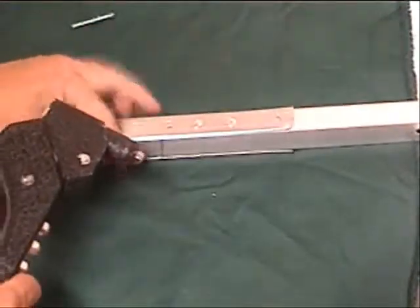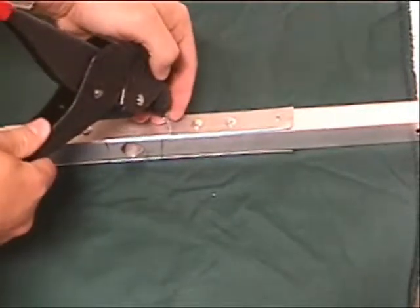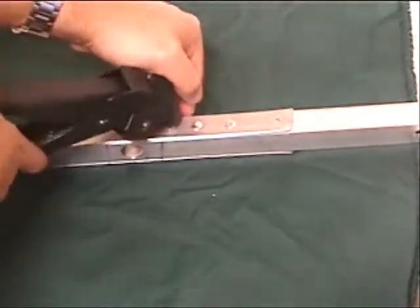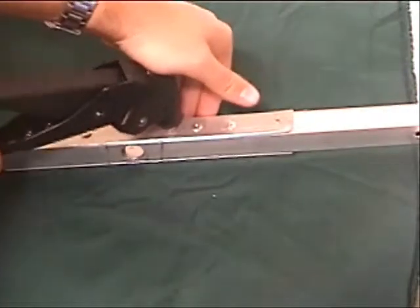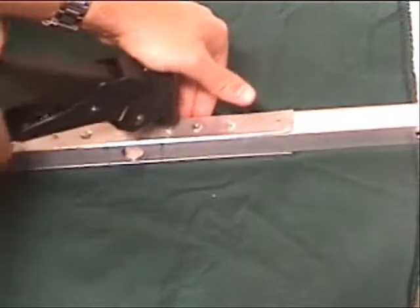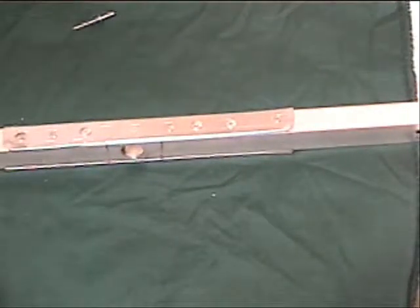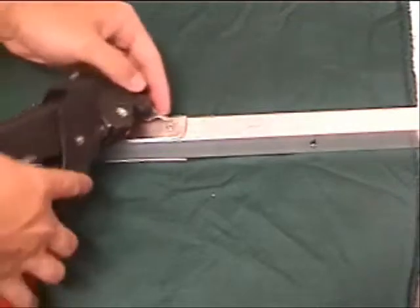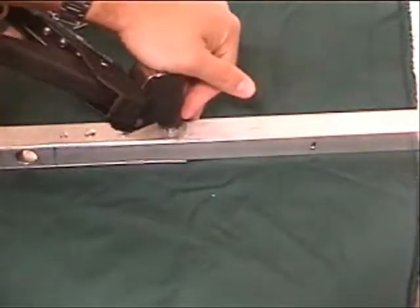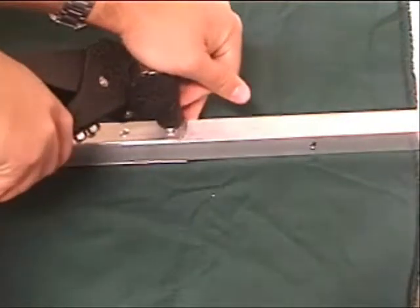Just slide it on over. Sometimes you can slide them in here, press it down, keep it straight. If that mandrel's sticking out, you can bend it, and that'll just jam up the gun. If you do get the gun jammed and the mandrel doesn't want to come out, ask one of your teammates to help you out. Last one here. You can see this one spins. If you need to get it in a tight location, you can spin the handle of the gun.